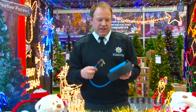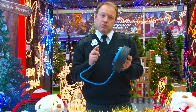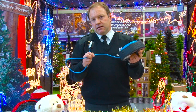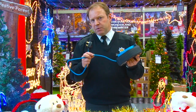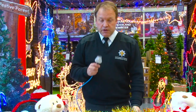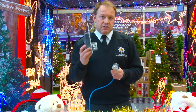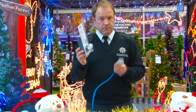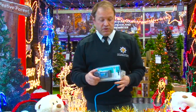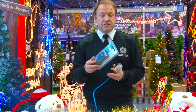Another form of extension we've all got is the drum extension. Quite useful, but bear in mind when you use this you must pull the cable out to its full extent. That's going to pose a bit of a trip hazard so be careful where you use it. If you are going to use the drum, you need an RCD adapter. This plugs into the socket in the wall and then the plug goes into the adapter. Then if there is a problem with the cable or the Christmas lights, the adapter will kill the power in 0.3 of a second.